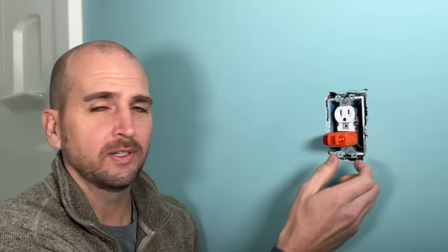Go ahead and remove the wall plate. Now that we're opening things up, we obviously want the power to be off. I've hit the circuit breaker and I'll confirm that with my outlet tester. No LEDs lighting up for the bottom or the top, so we're good to go.